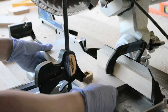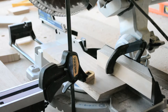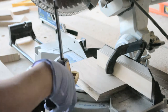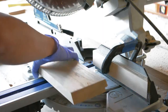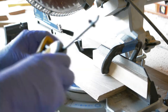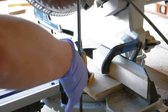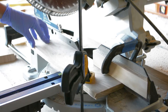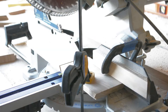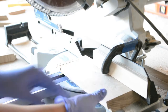Now I have to cut out six pieces with an angle on both ends. For me, cutting an angle on a miter saw is kind of awkward — it's easy when I have a long piece I can hold with my left hand and cut with my right, but sometimes I get short pieces that I have to hold or clamp on the other side of the blade while I operate the saw with my right hand. I tried all different kinds of clamping mechanisms and each had its flaws. For angled cuts especially, you want to make sure the piece is perfectly steady and not lifted off the table. It's quite an unforgiving cut, but luckily I only had to make six pieces today, so I survived.